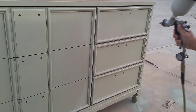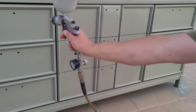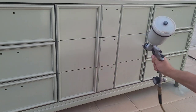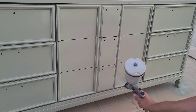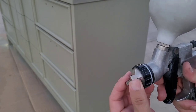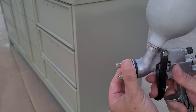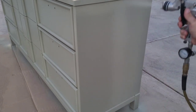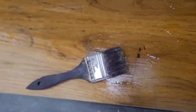To figure out the settings on your gun, make sure you spray onto a piece of cardboard first — this lets you know it won't come out with a weird spray or orange peel texture before you go onto your piece. Then work in small sections moving across the front without stopping. This piece took two coats of spray, using about half a quart of one hour enamel. You can change the direction of the spray by adjusting the nozzle — use a horizontal spray for the base and top, then fill in with a vertical.